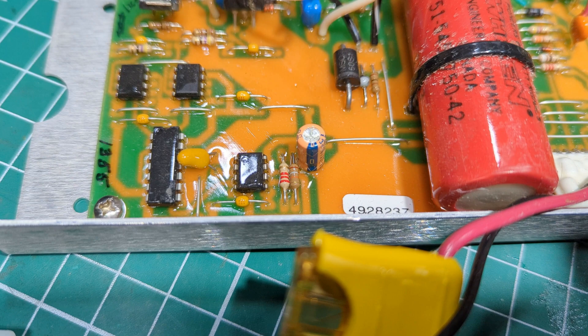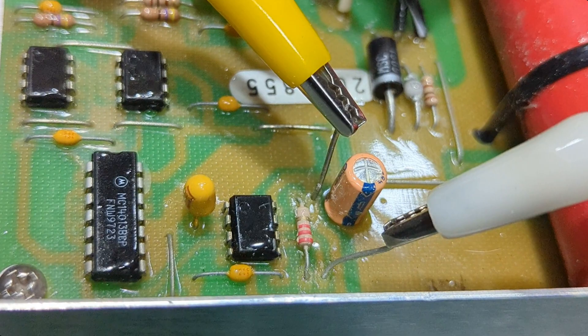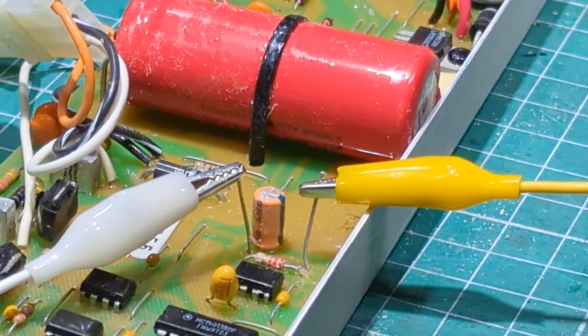We get our rate from these timing chip style boards with two resistors and a capacitor around the timing chip. The one on the right is 19k and that's the one we'll be altering. We've taken it out and put two pins in so we can connect our test leads and start messing around with what speed we'd like to change this to.